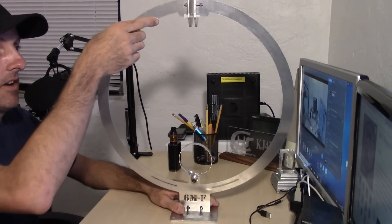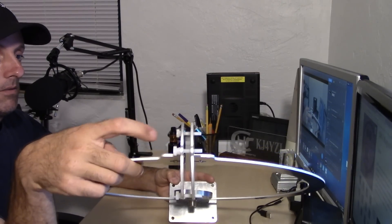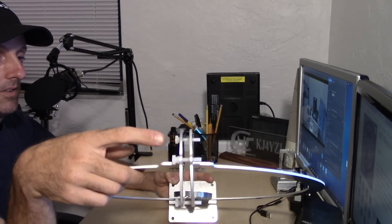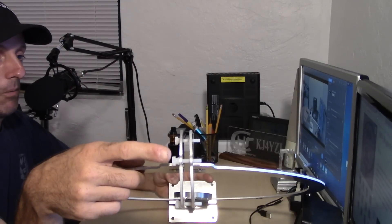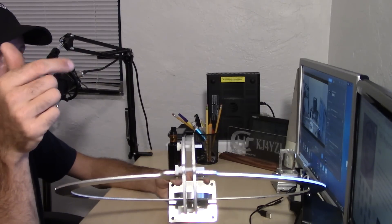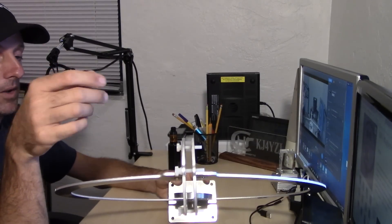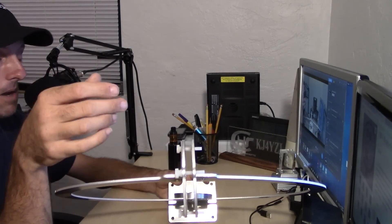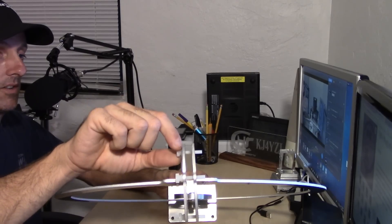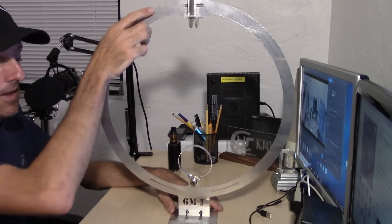I'll show you how easy it is to tune. When you get it in the rough ballpark, you adjust the screws one degree at a time. I found that to go from the digital mode section around 50.313 down to CW, I just tweak one screw a degree or two. To go all the way up to 53 MHz for FM repeater operation you might have to tweak all of them a couple times, but from CW to sideband it's probably less than a degree.